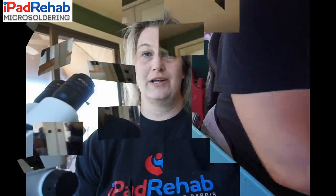We're going to reball the board. My suggestion is to start with a really low melt, like 138-degree solder paste, and then work up to something more robust — ideally regular 63/37 leaded 183-degree solder. Kind of work your way up to that, but make it easier on yourself when you start out. Things are always going to be easier when you're using the lower melt stuff.